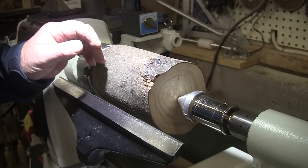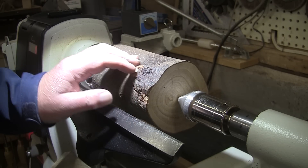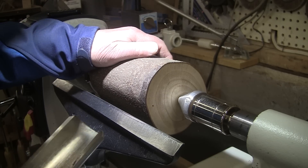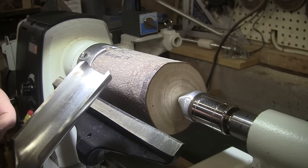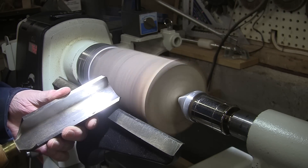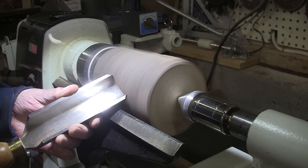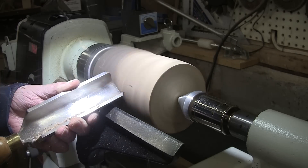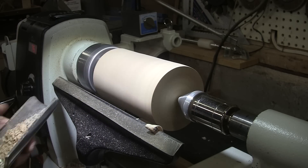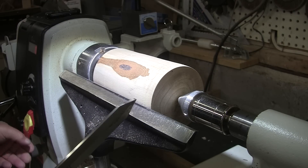You can hear my heater running — that's because we're back to not freezing cold, but chilly. It's about 48 degrees out here. Change of plans: I'm gonna use a roughing gouge. I'm not gonna make any attempt to save any of this bark because it's a vase, I guess. Because it's mostly round already, I'm just gonna take it down to round and then start shaping it. 750 RPM, spindle roughing gouge, mask and face shield on. Okay, well that's pretty round.